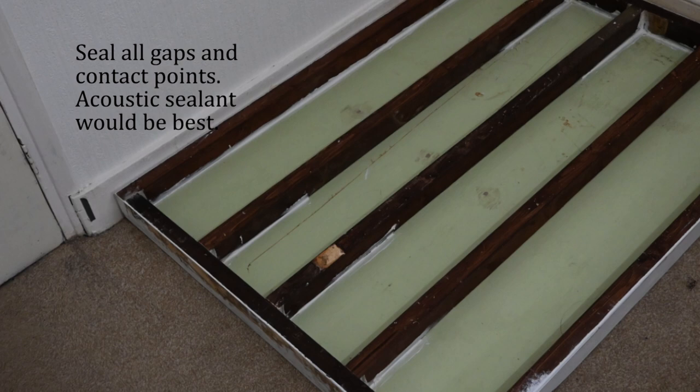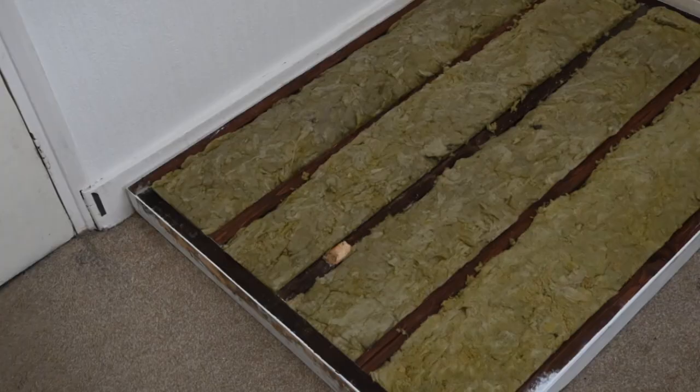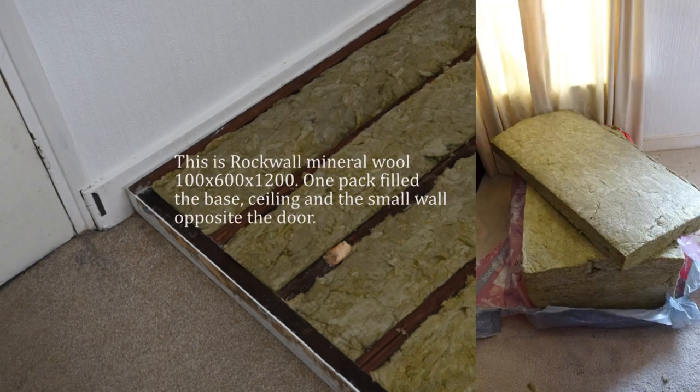These little things are going to make your booth successful. If you put your lid on the base and seal it up, you'll be left with hollow spaces inside. Sound will get into those hollow spaces, bounce around, and amplify like a drum - so you really want to fill them. What you fill those spaces with depends on what frequencies you want to eliminate, how loud those frequencies are, and how much money you're willing to spend. For a voiceover booth in an already quiet room needing only low sound reduction, you could fill spaces with paper, towels, blankets, styrofoam, or polystyrene panels.